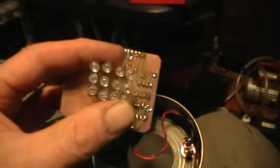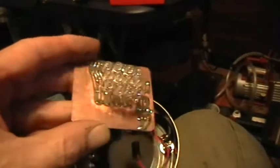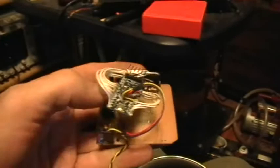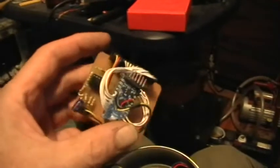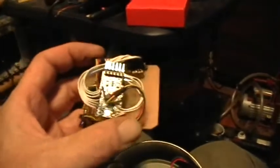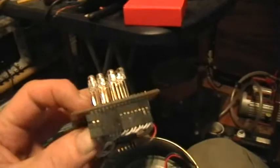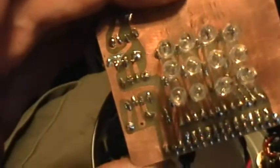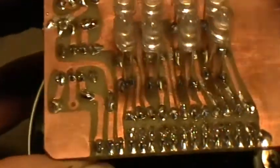The homemade PCB has a bank of LEDs — red, green, and blue super-bright LEDs. These things only draw about seven or eight milliamps each the way I have them set in there with their dropping resistors. There's also an audio preamp that feeds into the Arduino Pro Mini.